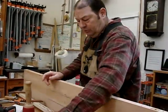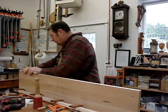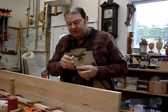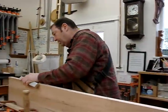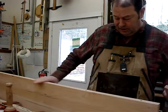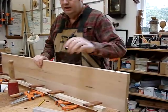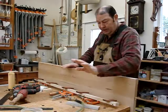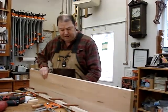Now that's the female side — we'll touch it up with just a little sanding. My sanding block is just a piece of MDF with PSA adhesive sandpaper wrapped around it. I break the bottom edge a little and the top edge a little. Notice I haven't done anything with the ends yet. Now I want to blow this out. These are nice clean holes — even being reamed, they're nice and clean. That takes care of the female side. Turn this over.